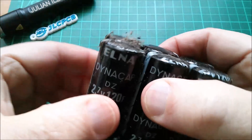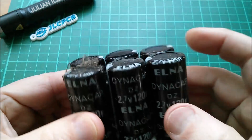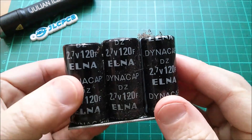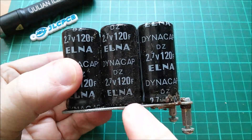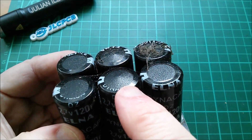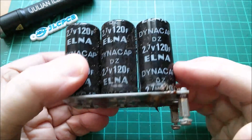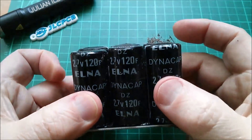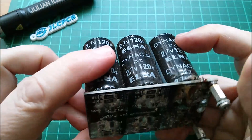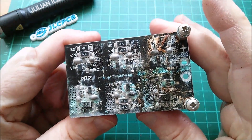One thing I've noticed is that two of the caps - these two middle ones - appear to have puffed up a bit. This one is definitely showing signs of puffing up at the bottom as well because the whole thing has lifted up and the bases have puffed out. I'm just wondering whether the protection circuits stopped working and these have either gone quite badly reverse voltage or over voltage because the protection circuits have just packed up.